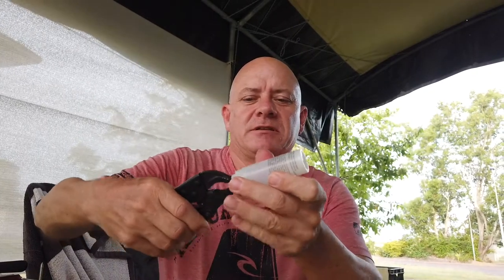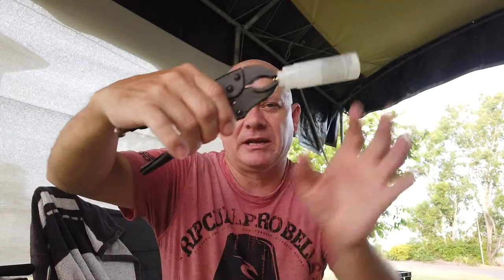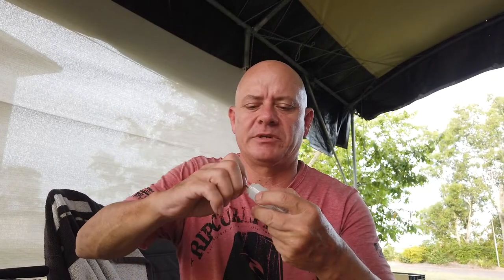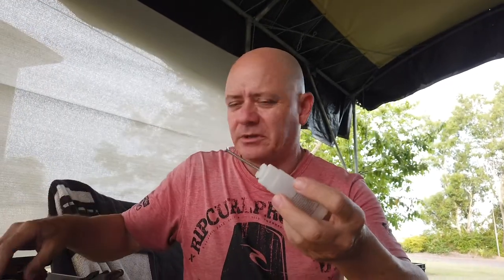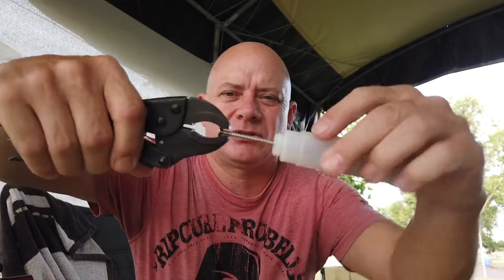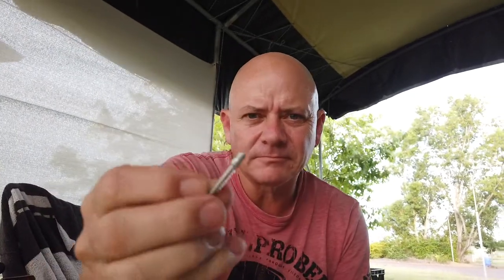Following the instructions, the little brass fitting is a press fit, so I'm only lightly clamping onto this. There we go — press fit — and pull it out. You won't see it, but inside there there's a little grey one-way valve. We need to get that out, and we're going to get that out with a screw. I'm just winding in a little bit — it's a wood screw. I've got the screw to bite. There's a bit of a squeaking noise you can hear, which means the screw has actually gripped onto it. Still with my vice grips, I'm not holding onto the screw too much, and then pull that out. There — a little grey valve.